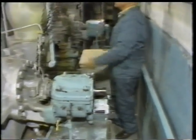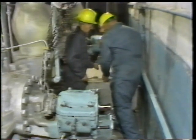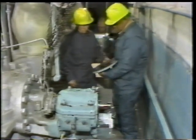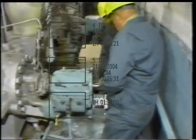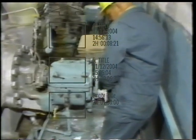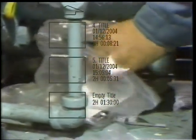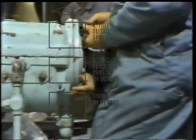With the gaskets in position, he signals his helper to give him a hand installing the end cover. Since there are no studs to hang it on, installing the cover takes a little help and coordination. After checking the sealing surface on the cover, he and his helper place it in position, taking care not to disturb the gasket and also positioning the cover so the bolt holes are lined up. Then, while his helper holds the cover in position, the worker installs the bolts. He threads all the bolts in hand tight and then tightens them with a wrench, as always using a crisscross pattern.